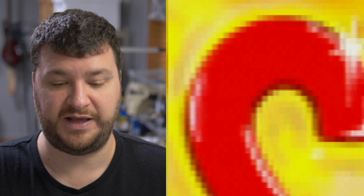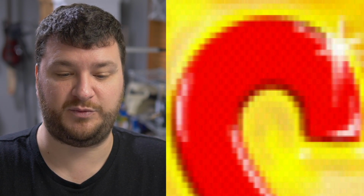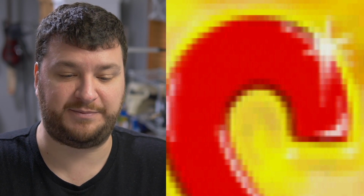Now, the other reason that you might be interested in this is the quality. The board is obviously routed perfectly, because with the brightness turned up artificially in Photoshop, the title screen picture that I took looks perfect. Same with using the HD Retrovision cables. But I also found out that the basic RGB SCART cables I were using, which I thought were shielded, were not. So if you're watching this on video, you're seeing a zoomed in title screen with a checkerboard pattern, meaning that the cables aren't that good. But you go back to the Humble Bazooka adapter with good shielded cables, and it looks perfect.